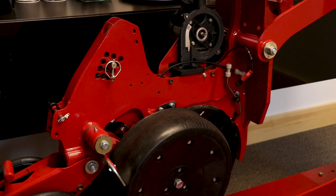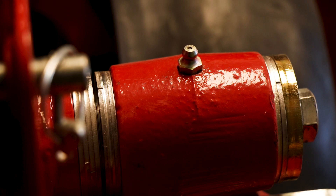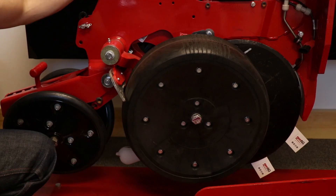Daily greasing on the machine is pretty simple. If you look at the undercarriage, the whole frame of the machine, you've got every pivot point on your bar and then as well for folding the machine, grease points. On your row unit, very simple daily grease. You have each gauge wheel with a grease zerk on the bushing, and then as well as our Paralink arm bushings get a daily grease, a couple of shots a day, and that's about it for greasing.